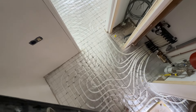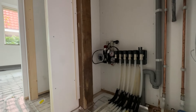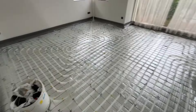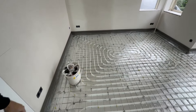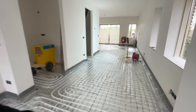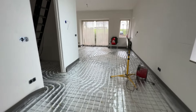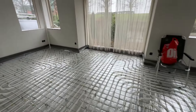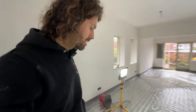You can see it from here. The plumbing from the floor heating is all finished. It comes out from there and it goes all through the floor all the way out here, so that all gets heated up and heats up the floor underneath it. All the floor heating pipes are in. The water gets pumped through these, it gets heated up and the pipes heat up the cement that's around it. We're not having sand cement — it's a thing called Magnesite, and the Magnesite is like a liquid mulched up wood, so it's a lot lighter for the floors. Then that heats up the room. So that's how the floor heating is going to work.